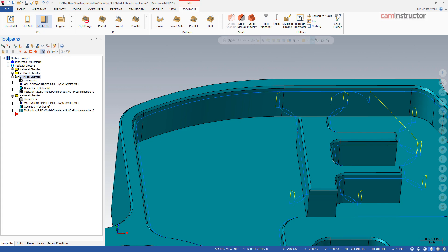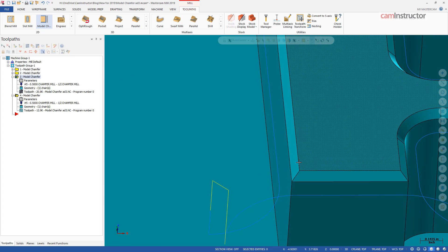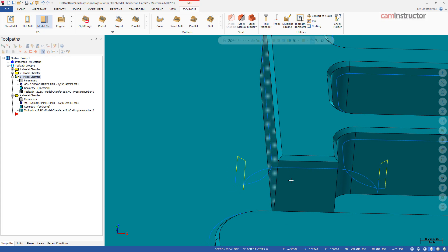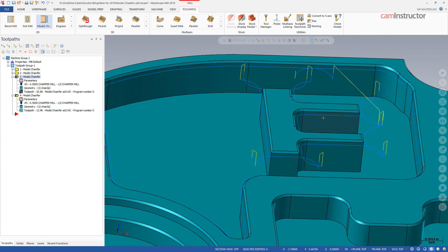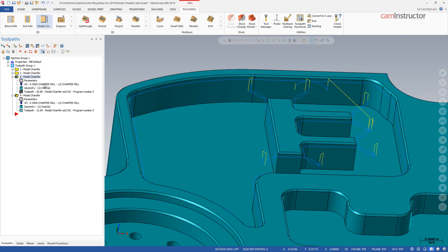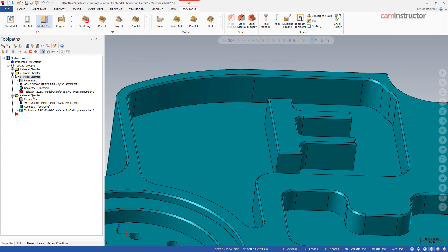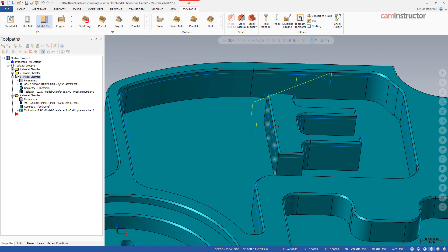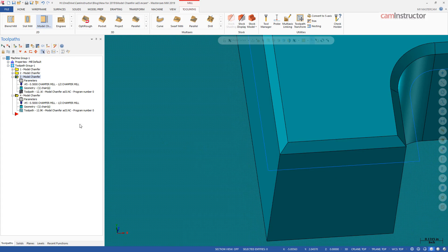The reasoning behind this is the sharp corner. If we chain the geometry at the top, basically what happens is the arc of the toolpath violates the bottom corner of the chamfer. This toolpath sees that as a problem — its whole point is to avoid gouging into the solid model — so it does a reposition to recut. You can change that behavior in the toolpath by coming in and turning your roll cutter parameters to none. That will fix it, so now we're getting the full chain with no repositions, but notice we've lost the smooth transition around the corner.